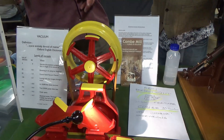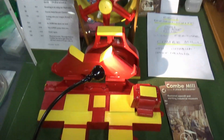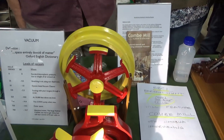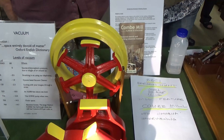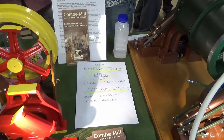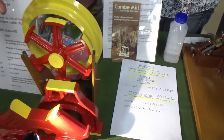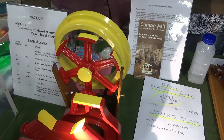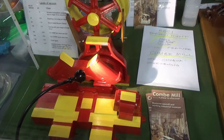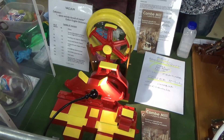You put that pattern into sand and poured molten cast iron metal, then cast it and machined it afterwards to get it on target with tolerance. The colours are here because it's important to identify which areas will subsequently be machined — all the yellow areas will be flattened on a milling machine — and all the red areas would be left rough and natural.